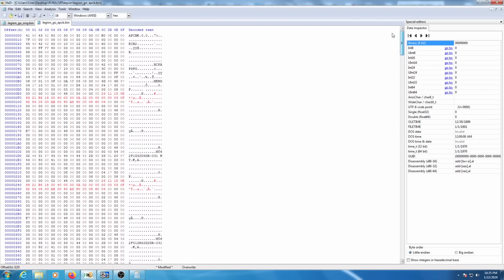The reason I've done this, and by this I mean replace every single instance of SPD data, is just because there could be different memory configurations on these boards that are set via strap configuration resistors, and we want to make sure, regardless of what that strap configuration setting is on the board, that our modified SPD data is loaded, because we know what chips we installed and we don't need to worry about any other memory configurations.